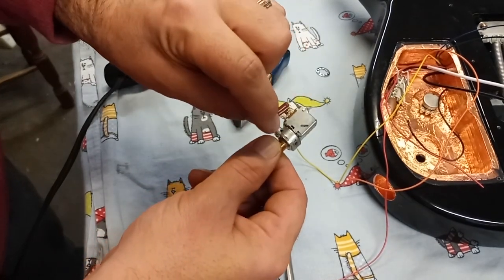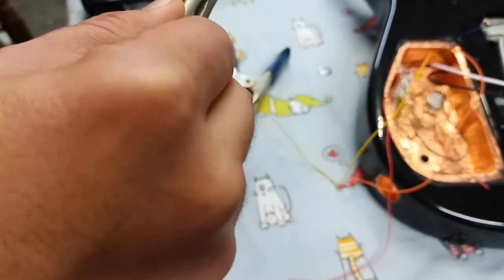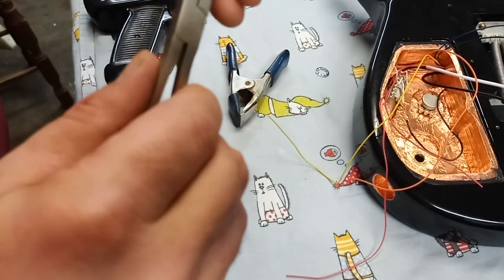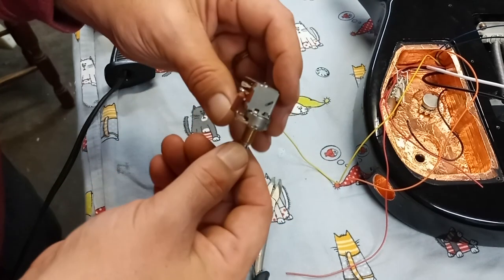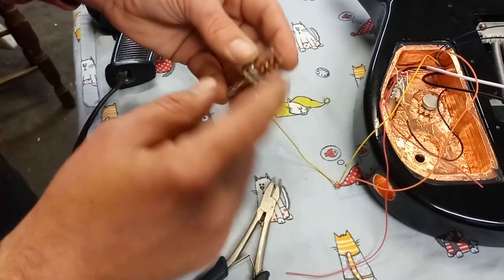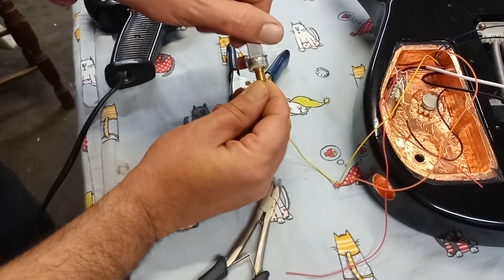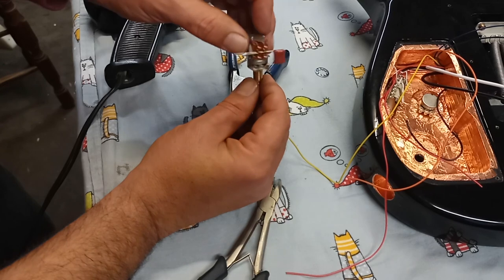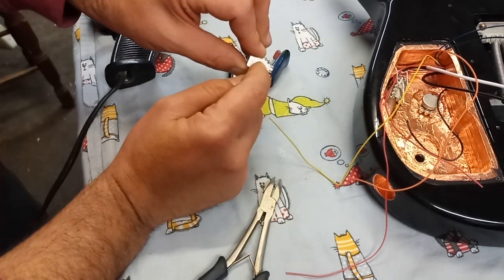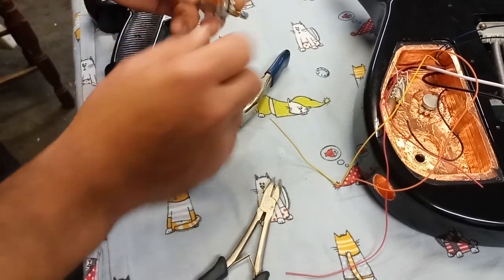I have to trim the back of that tab a little bit. It touches the casing. I could just fold it. Oh, screw it. There. Oh, hooked it out so it's not contacting. I'm going to bring this piece over top. This is going to be my ground lug on this piece, because there's not much surface area that you can put a ground wire on that tiny little pot. It's the sad thing about these little fellas, but anyhow, they did provide this tab at the top for grounding, and we're going to use it. So let's make that work.